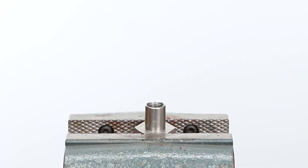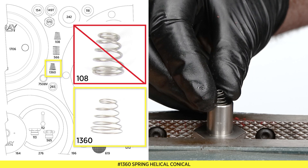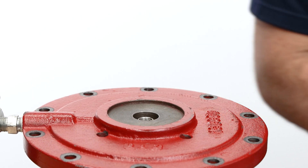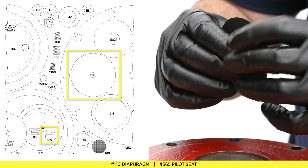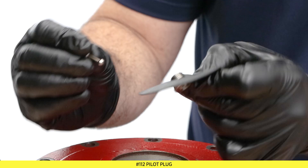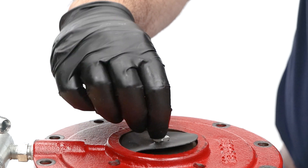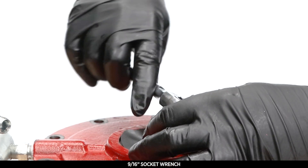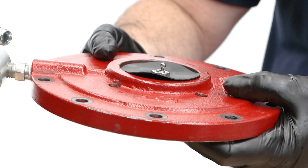Place the stem into the vise with the female threaded end facing up. Place the conical spring widened-end down into the stem. Place the lower pilot housing onto the stem, painted side facing up. Install the diaphragm onto the pilot seat. Place the pilot plug into the pilot seat, small ball first. Holding this assembly by the small ball of the pilot plug, hand start it into the pilot housing. Fully tighten with a 9/16 socket, but do not over tighten. This assembly should have play in it when removed from the vise.